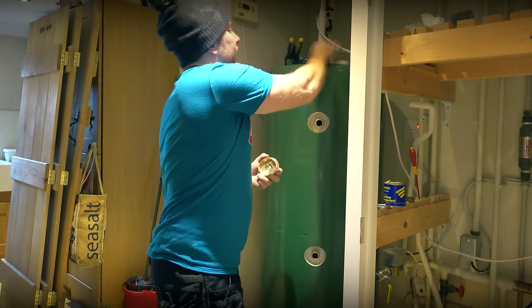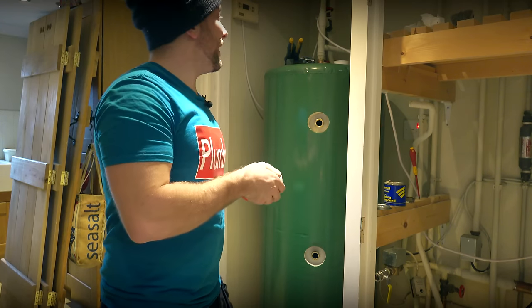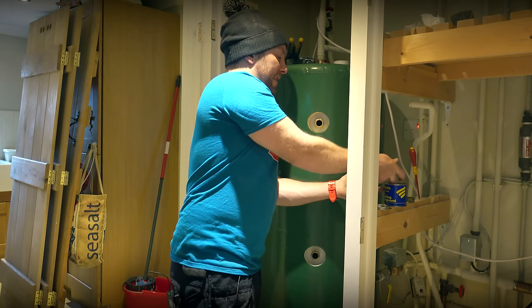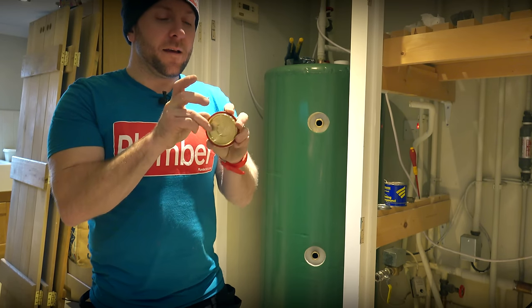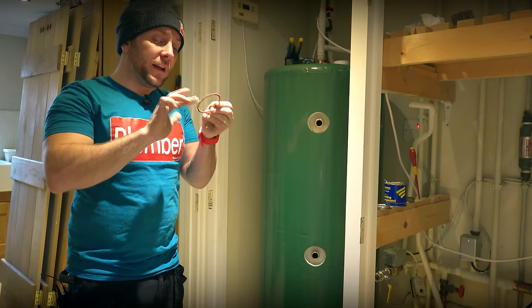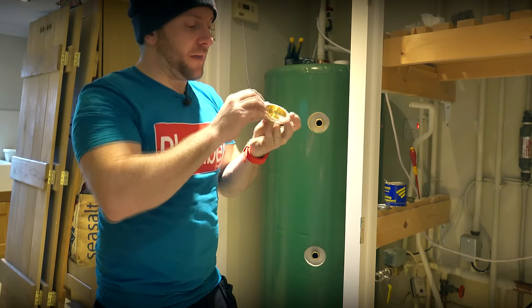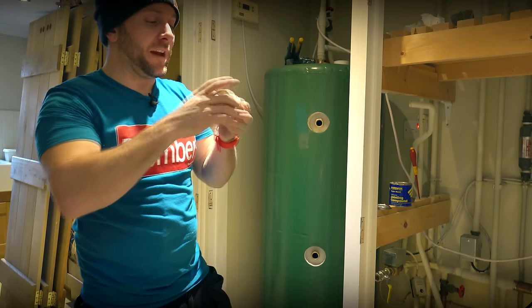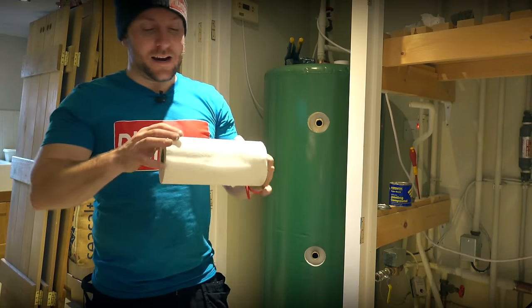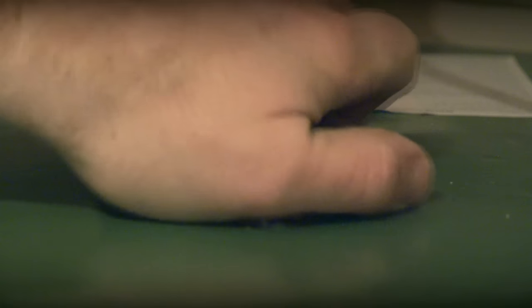First thing as a caution: get that immersion hole blocked up, because if you drop anything down there — like your pipe slice or something — you're literally going to cry. Usually with these you get a nice little fibre washer, so make sure you get plenty of jointing compound on either side of the fibre washer before you put it on, and make sure the face of the immersion heater is nice and clean. I always put a little bit of PTFE around the thread as well — some might say it's over the top but I don't want a leak. Go backwards until you hear the click, and then once the click happens you can run forwards again — that'll hopefully prevent you from cross-threading it.